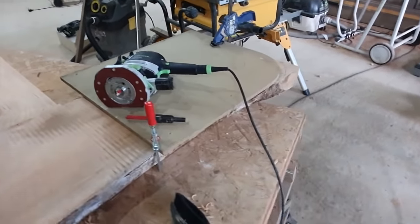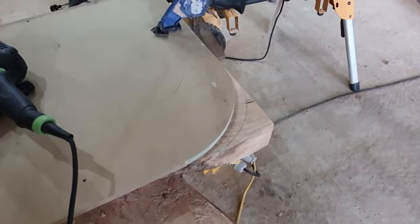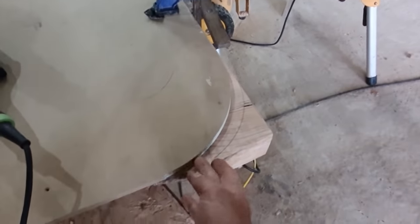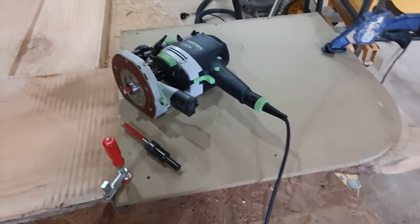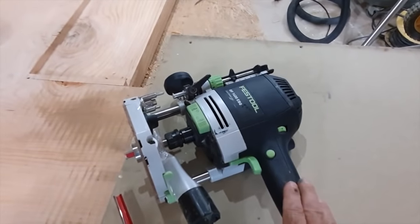The template, I'll just take you around here, the template is set back about 8mm, so when the cutter comes through and comes round, it removes what I want it to remove. Now, to do this, I've got a fairly long two-flute cutter in the router.